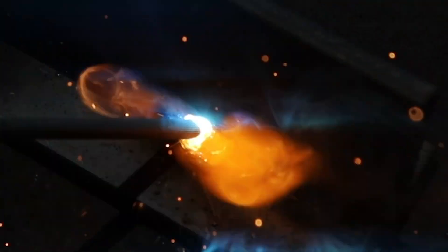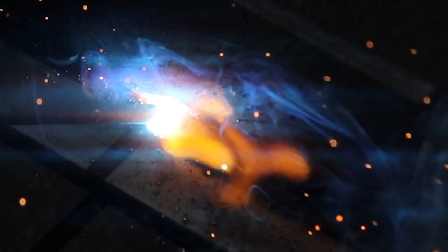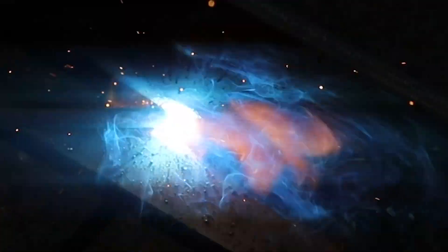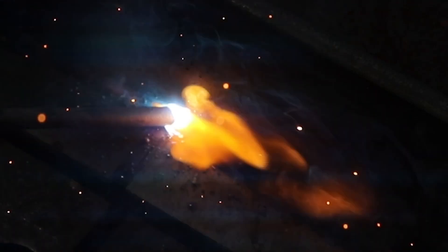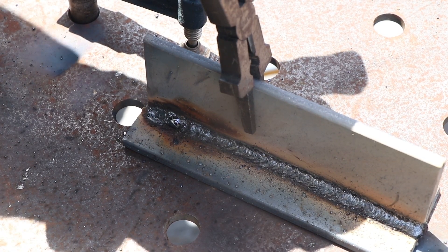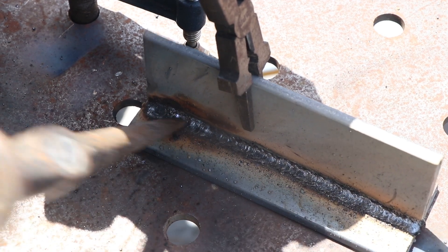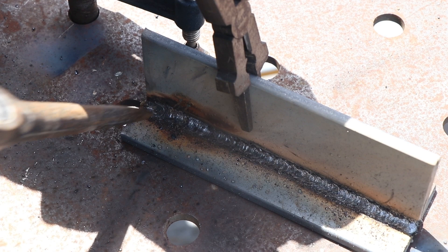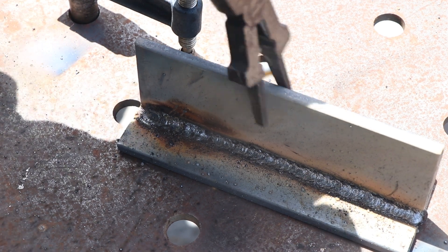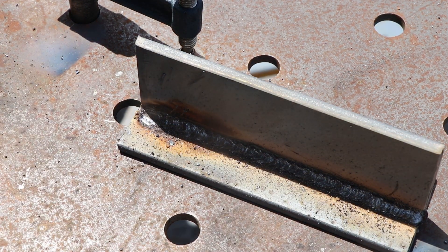So when you're running a 6010 with the Cyclone, I'm not going to say it's a trick, but there's a technique. When I was doing the root, I was doing a quick, tight arc, forward-up-back movement. And every time I run one of these machines, it runs good. The trick is to keep that tight arc. Just did some quick cleaning up — I could probably use a wire wheel right now. I could have slowed down, I could have stopped right there and let that fill a little bit. My hand was kind of in a weird spot, but yeah, it looks good overall.